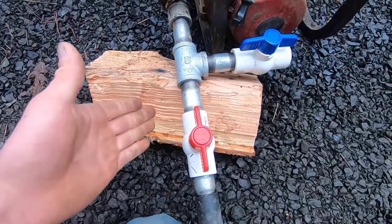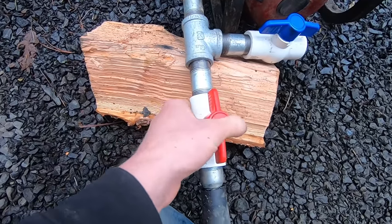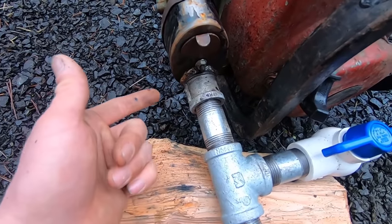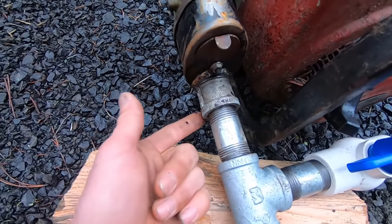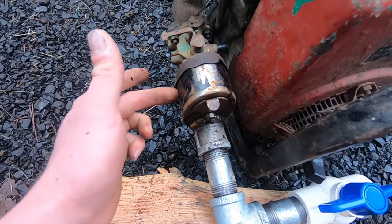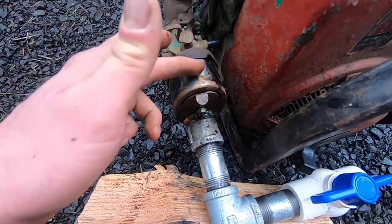And at this point, the gas is cool enough that you can use PVC pipe and valves because it's cheaper and you won't have any issues with melting. So all you need to do is add a method of inputting your gas air mixture into your air intake. Specifically, if you can, on the outside of the air filter to add one final step of filtration before it gets into your engine.